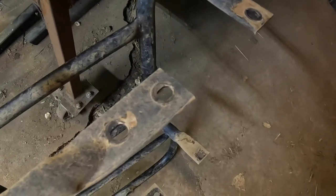You can kind of see what their strategy was for attaching this to the four-wheeler — they just took pipe and smashed it flat so that it would bolt up to the frame. I'm not going to do it quite like this, but I am going to copy this design. What's going to be easier and actually a little bit stronger is to cut some tabs out of my 1 by 3/8 flat bar, then notch some tube and weld those tabs in the tube so that they bolt onto the factory holes and the pipe comes up through the plastic. If it doesn't make sense, just give me a minute — I'll show you.